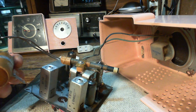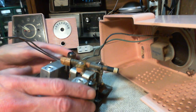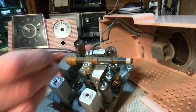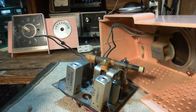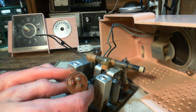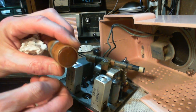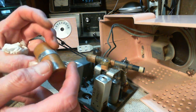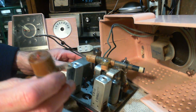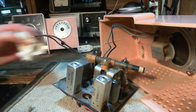There we go. I'm supposed to strip these wires and then hook up capacitors to them. What's all this gunk? Let's see how cracked — can you see that in the camera? The bottom seal is cracked everywhere, cracked in all directions. Even the top one has got cracks in it too. Now, that's going to let moisture in. Wouldn't be surprised if we put a voltmeter on these leads if we don't see a little bit of voltage coming out of this.